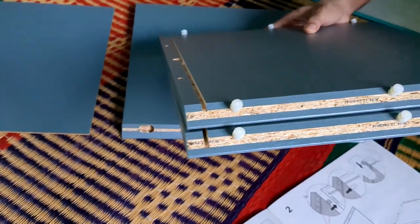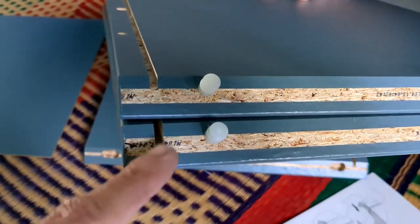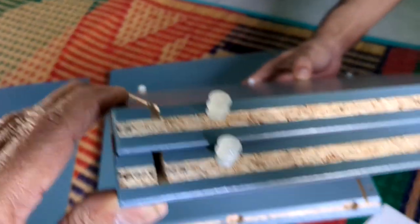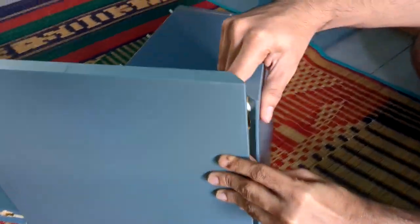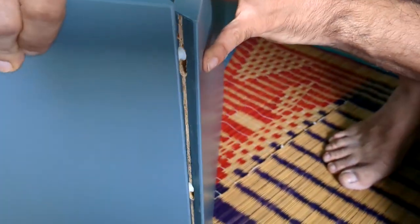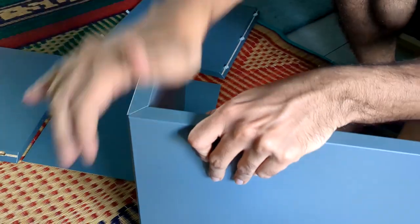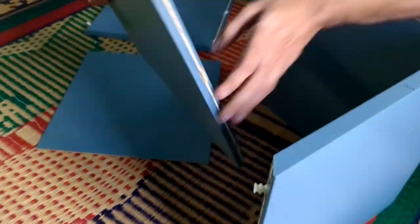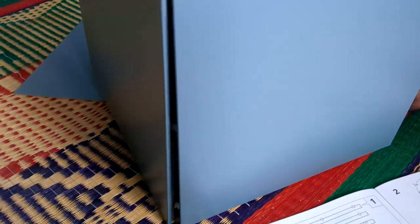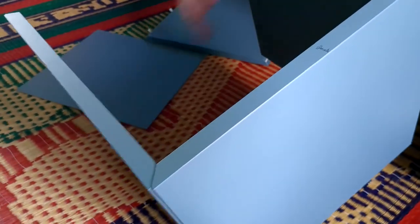In these 2 panels, the bottom is marked number 1, the groove of which is deeper compared to the other panel. Firstly, we join the panel marked 1 with the adjacent panel. The wedge dowel clicks into the groove. Similarly, the other plank is fixed on the first plank. You just need to gently hit with your hand or use a plastic mallet.